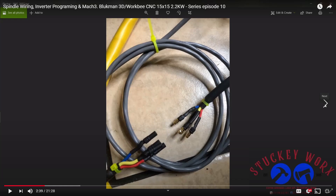If we have a live lead and it makes conduction to another lead or to the metal chassis he's using, he now has an electrified chassis. We are potentially starting a fire. We are potentially getting electrocuted. We have to think safety first. This is a complete reckless disregard for safety — in the event this unplugs, I do not see a happy ending. You're going to have arcing. Something is going to be destroyed because the chassis is conductive. If you run 110 volts through a conductive chassis, you are definitely going to find low-voltage problems across the board — through the motors, through the drives. This is just explicitly dangerous.